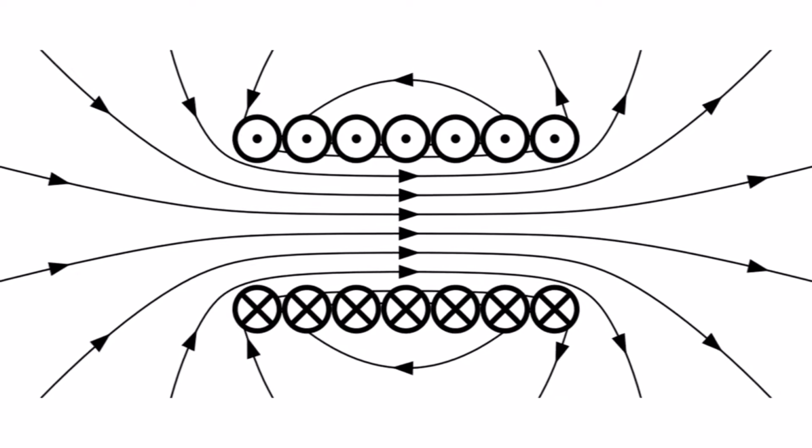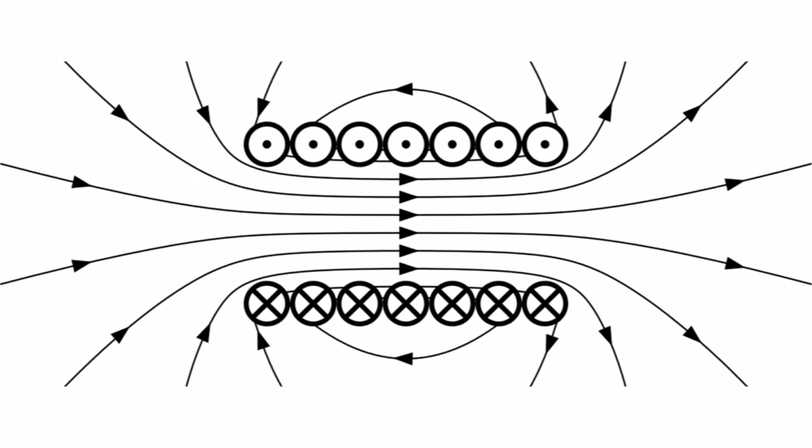But when we get into the world of AC and impedance, things get a little more complicated. Impedance and resistance may share the same unit of ohms, but the way that impedance reacts and behaves is kind of a strange beast. You see, if I put a 60 hertz sinusoidal wave through the speaker cabinet, you might be able to measure a certain impedance, call it 2 ohms, just to be simple. However, if you double that frequency, you might measure something entirely different, say 16 ohms, maybe even 20 ohms, 10 times what you measured before. But then you might measure a different fall off if you double it again at 240 hertz.